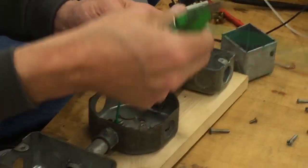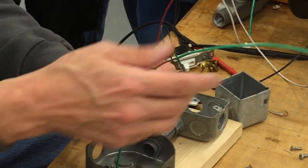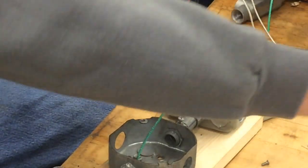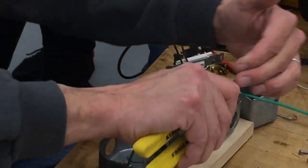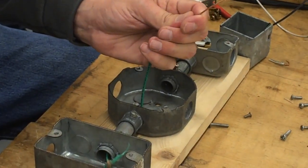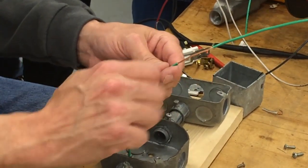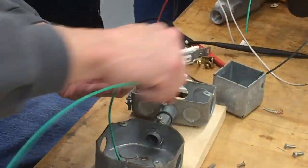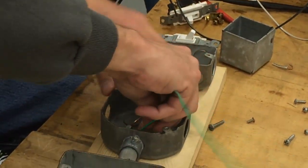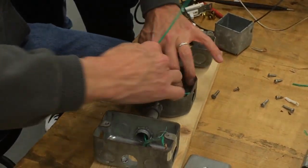And you just come down like that. Now I've got it off — I cut the insulation, not the wire. If it's real long, you can do it, but it starts to bind up a little bit when you're pulling it. So it's up to you what you want to do for the center one — you can slice it a little bit, or you can try and pull it. I'm going to go ahead and make sure it hooks around the one screw, tighten it up, and then move it on to the next box.